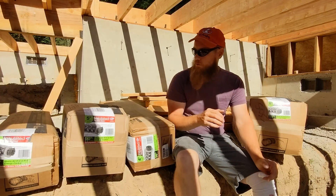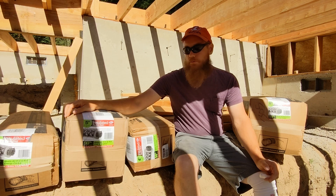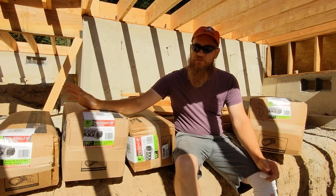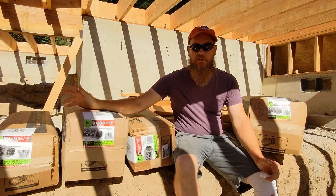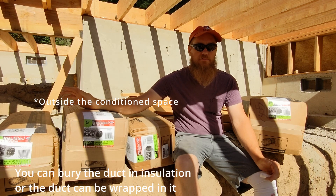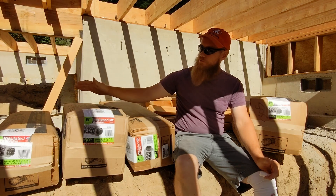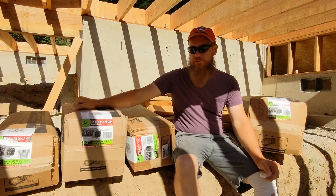So I'm gonna switch gears. What we're working on now is number two out of three major things that need to be done before we can get to the underfloor inspection. There are two major types of HVAC for whole home: ducted metal duct and flex duct. In Oregon, there's a requirement now that you can only have uninsulated duct work up to five percent — and that's not a whole lot. So what we're choosing is flex duct because it comes with the insulation already attached, and the price on it, especially with metal the way it is, is just hugely different.